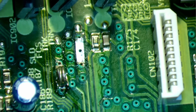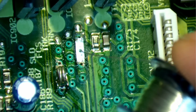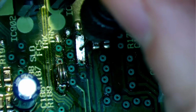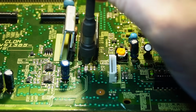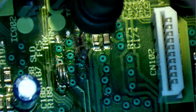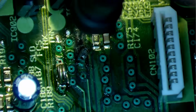So I'm going to need the microscope again, it's getting little. Got some tinned copper wire, I'll gauge it, see if it goes in the hole. It does easily. This is 0.3mm diameter. So I've got a little drill bit, it's 0.4mm diameter. I'm going to put it through then, very carefully drill that out, going very steadily. This will actually wipe out the via, I reckon. There we are, we're through. Got to do it again to this one. And this one's through as well.